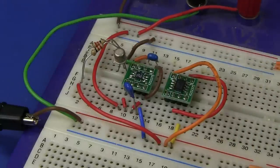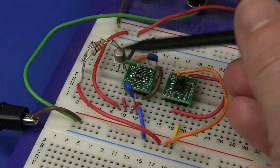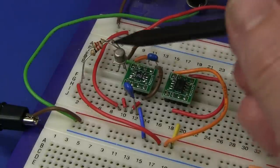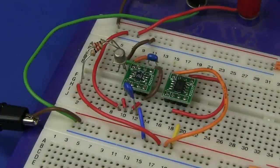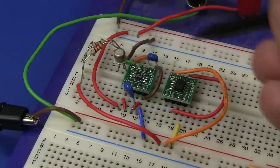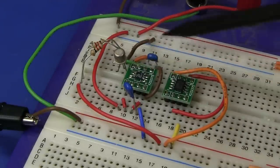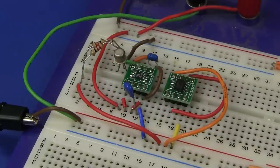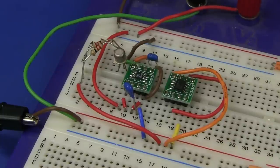So this damn thing didn't work. What I've done is disconnected the op-amp — just imagine that's not there. I've just got the voltage reference with a 2N2222 transistor, and a load of two 22 ohm resistors in parallel. We're talking about 110 milliamps or thereabouts — well under the 1 amp I want. I just scaled it back to get exactly the same circuit in the application note. I've got no bypass caps directly on there. The idea was that if it worked on a breadboard with bypass caps a centimeter or two away, then on the final PCB with tighter loops it would work a treat.